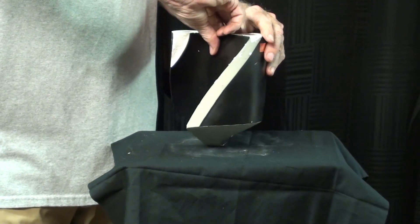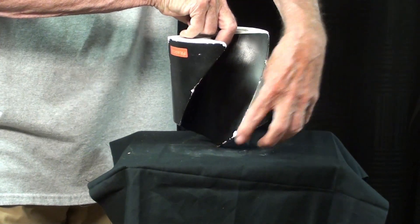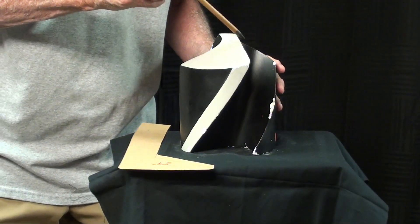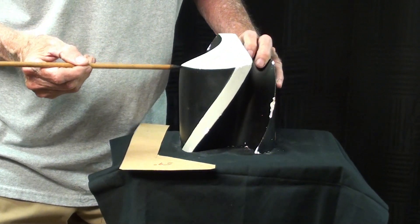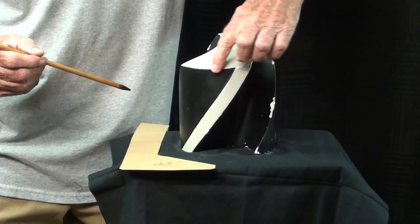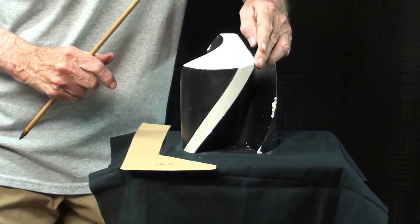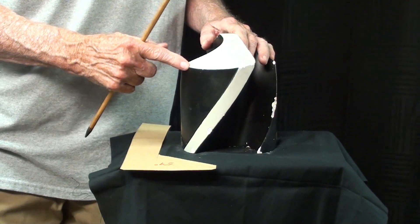This is the action of the drill — a right-hand drill — with the lip here doing the cutting. In review, this is the cutting edge, or the lip. This point right here is called the heel. We need to have an angle here of 8, 10, or 12 degrees depending on the diameter of the drill. You want the lip to meet the work first, not the heel — otherwise you're just rubbing.